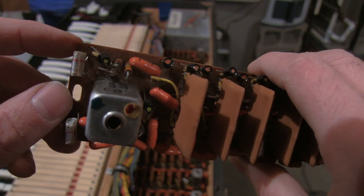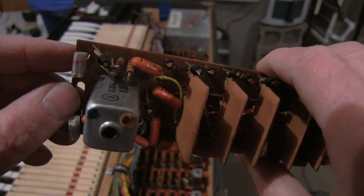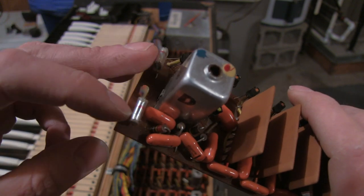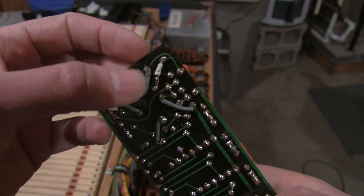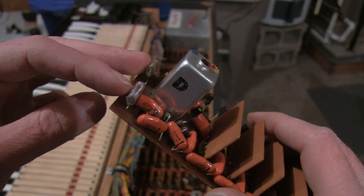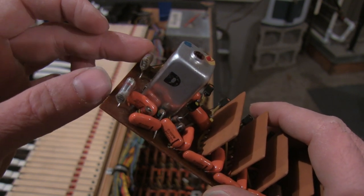And I noticed that the C sharp that I just repaired was like a fifth sharp. And what it is, the traces to these capacitors, both of these, between here and here, were broken. Just barely hairline fractures. And so if I would push on them a little bit, it would snap back into the right octave and snap into tune.